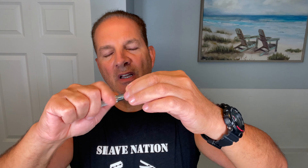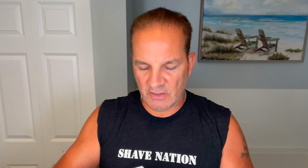Just drop it right over the threaded post and the two pins like so. Reinstall the safety bar with the striations or the grooves facing the blade — as always, never the other way. That would be backwards. This does have a recessed area where the handle meets up perfectly and locks everything down. You can see the reveal is perfect on both sides. As far as blade overhang, very slight on the outside edges — about 1/16th of an inch. Not much at all.